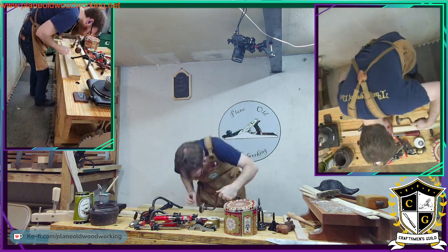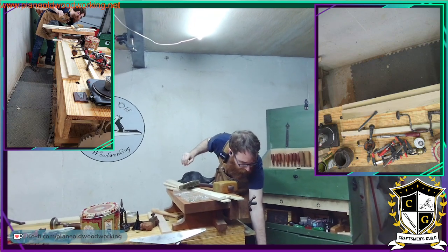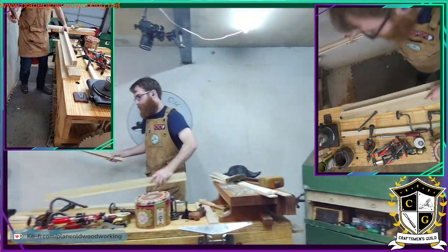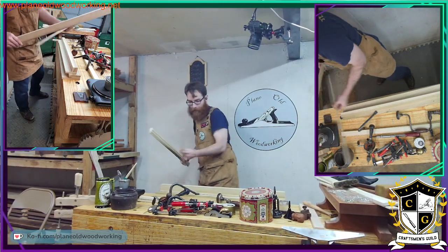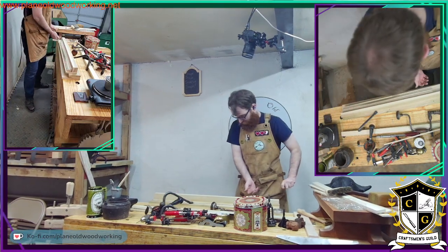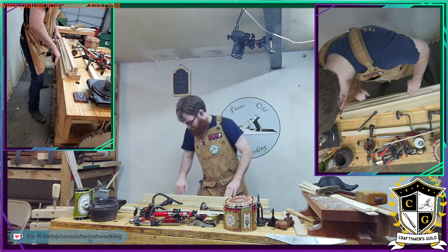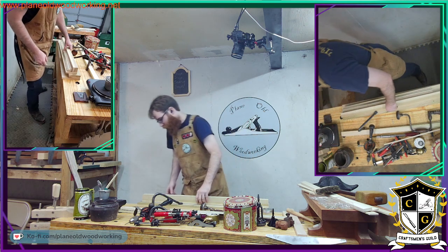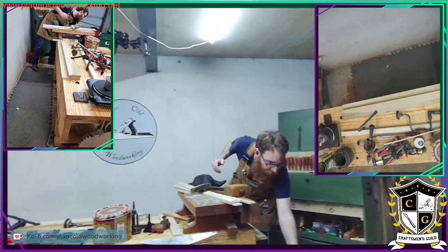All right, so when you hand make molding, I'm just going to give you a good idea here. This is an actual sticking board. This is the basic of basic. It's basically a vertical fence, a horizontal fence, and stops at the end. When you hand make molding, you throw your piece on, you've got your screws for stops, and then you take your hollows and rounds so that you have a way to hold down. It's stopped this way, stopped down, and stopped this way, so you can hold your planes in whatever direction. It holds the work steady so that you can build the different rabbets and fillets and curves